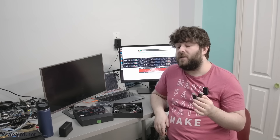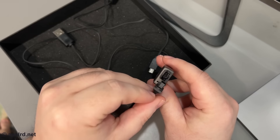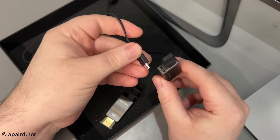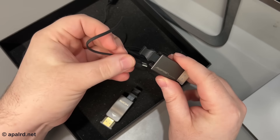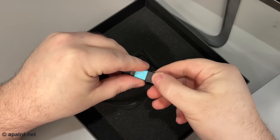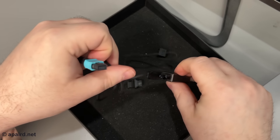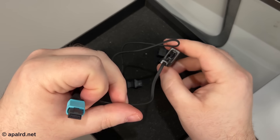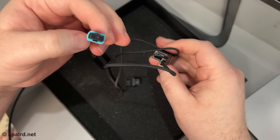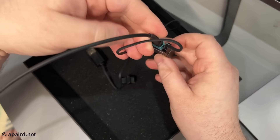Before installing, let me do a quick test. My educated guess is these transceivers are just taking the four high-speed differential pairs in an HDMI connector and running them straight into four lasers, transmitting over fiber with no buffering — just the photon travel time, which should be negligible. Now I'm carefully pulling off the dust cap to reveal the MPO connector, connecting the micro USB power, and plugging in the keyed MTP connector. My phone can actually see one of the lasers — pretty neat.